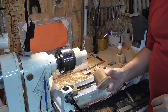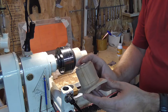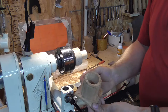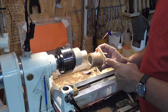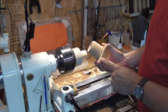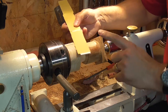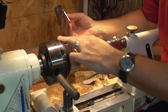This is my work in progress. This is the bottom of a box — this is olive wood. My problem is that here, on the points, I have ridges that I need to remove. I'm afraid to chuck this and use tools because I would have to go super fast, and if something goes wrong I may lose some of the points. So instead I will use sandpaper. I'm running through with my strips and I will come here and sand gently on the points.